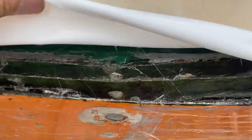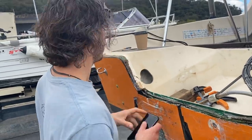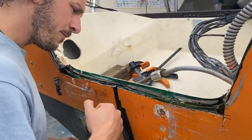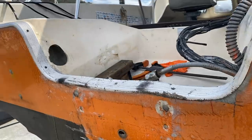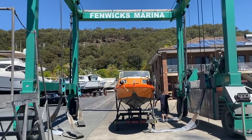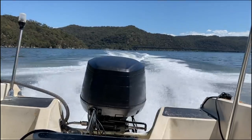Back at Lorenzo's boat the next morning — the Tangerine Dream — going to finish with our chopped epoxy. This is as far as we got last time. Quite a bit of fiberglass and epoxy in there. Finish it off, top cap it, let it dry. You feeling confident? Mate, it's a hell of a lot better. That engine — all 169 kilos — was literally just hanging on glass. No wood at all. Feels pretty solid. Once we'd filled the cavity completely, we put a top cap of solid glass matting, the aluminium strip back on, an aluminium backing plate, and then got the boat in the water for a test drive. On the test drive, we could see that all the flex that was there before was completely gone, so really happy with that.